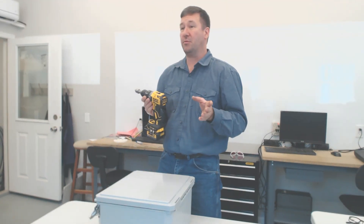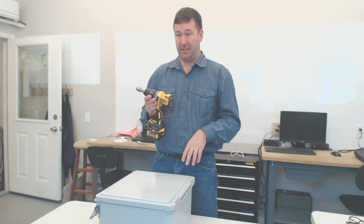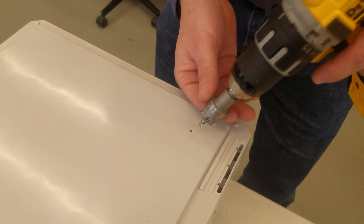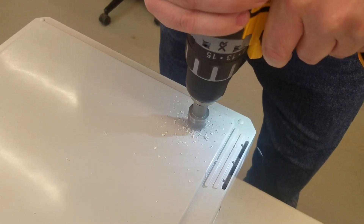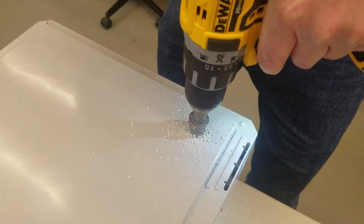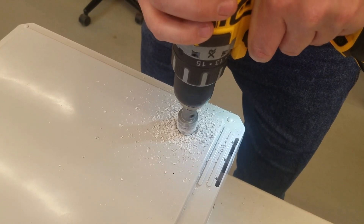To show you how it works, we're going to drill the hole into this fiberglass panel because it presents a few issues that steel does not. Make sure you measure twice because there's nothing worse than having holes that aren't in line. Place the center drill right in the middle of your mark — it has a very sharp point so holes are always accurately drilled. Right as it's breaking through, ease up and back off on the RPM. This allows the carbide cutter to start cutting evenly.